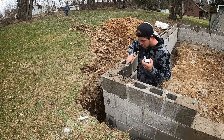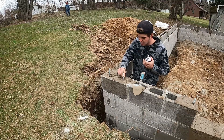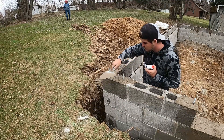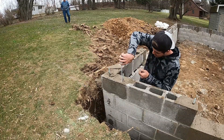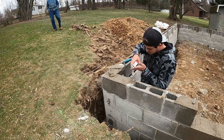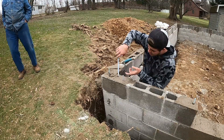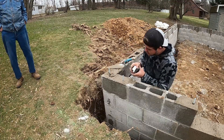Get that pile all up there, shake her down right to right there, give her a twist so it stays. Smooth her out. Now you can see where you're at — we are at three inches, so you're going to want to come down a little bit. You can tell too these threads are two inches, two and an eighth, so you know you've got to be right about there. I can eyeball them pretty good just off of the threads. Two and a quarter — you're good to go to the next one.